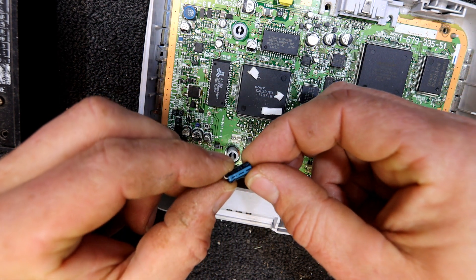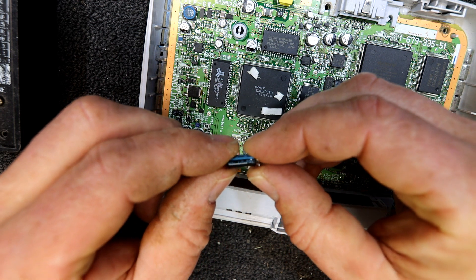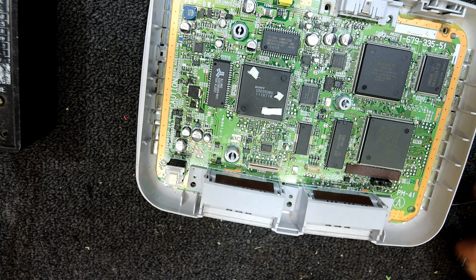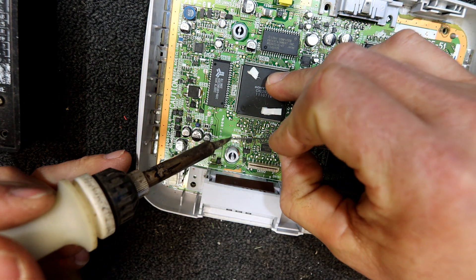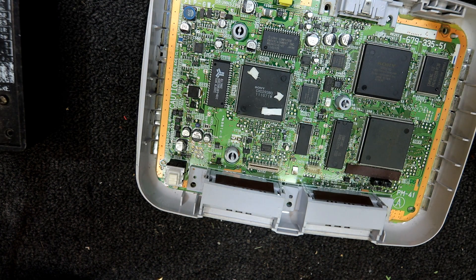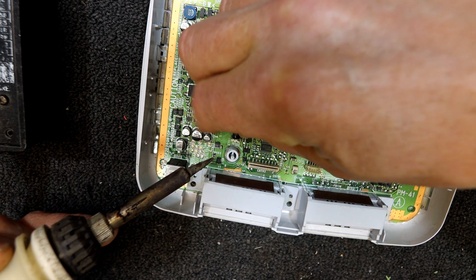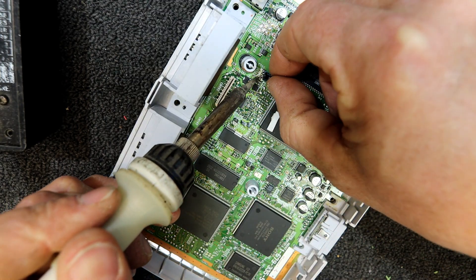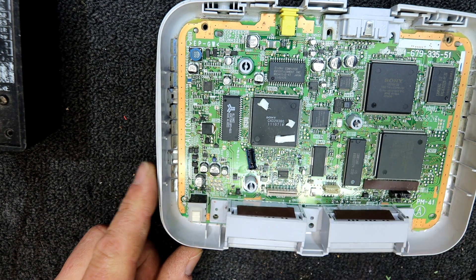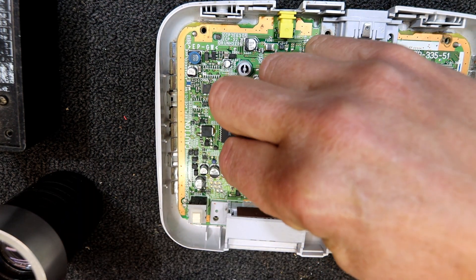Since I don't have any surface mount stuff in stock, or very little - I think there's a few left over from some Samsung TV repair kits - I just got one of these standard 0.47, 63 volt. Just bent the leads at 90 degrees and then bent them at another 90 degrees outwards. I might put a little bit of fresh solder on there. Because you've got that metal cover that sits in there, you've got to lie this thing down flat, just to test it and see if it actually did anything. Just check that you haven't got a bridge across to those other two little caps or resistors there - yeah, that's fine.